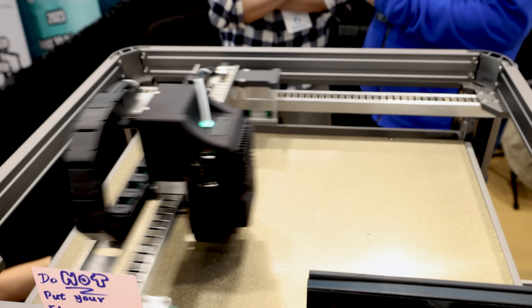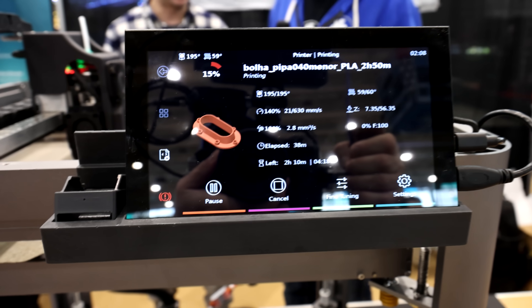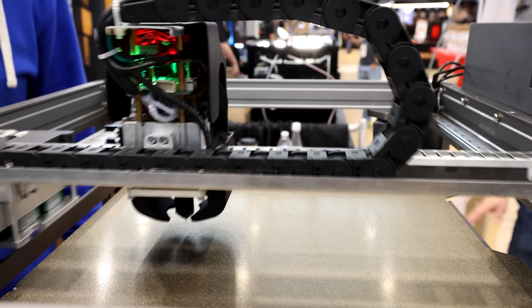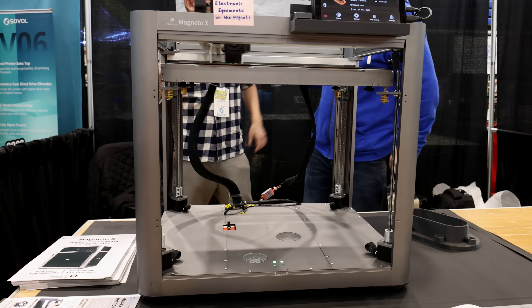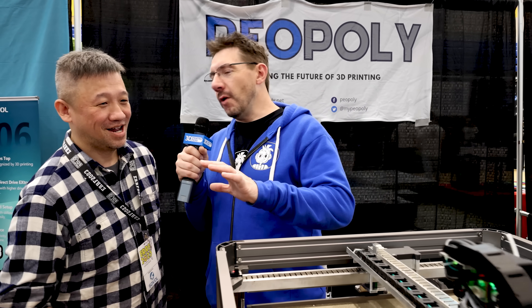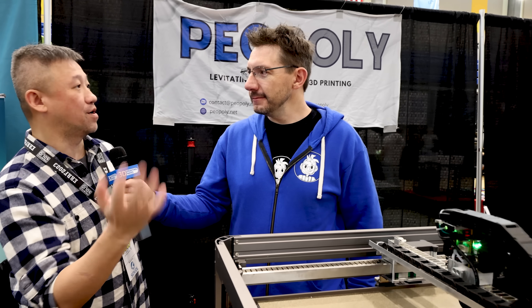It seems you met the challenge because this thing is moving along really well. One of the concerns someone online raised was about getting linear motors at that price point — you have this at $1,399 pre-sale — and whether they could perform at the accuracy needed. It looks like they can. There's actually a printed part here. How do you balance the performance, the price point, and how easy these can be manufactured? We got the precision down to about three microns. Most industrial linear motors are down to one micron, so this is not as precise as those. But to get from three to one micron is an exponential amount of money, and it would really be overkill for current extrusion systems.